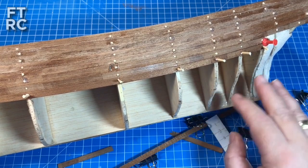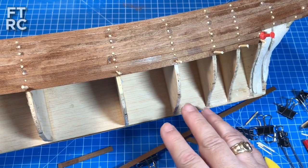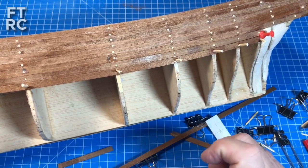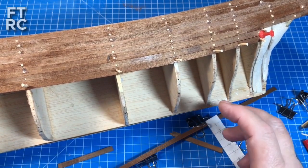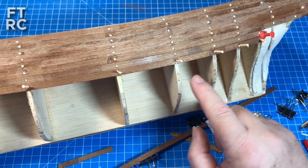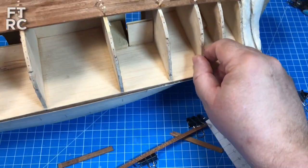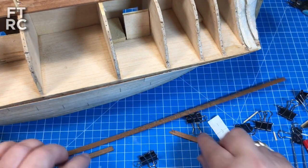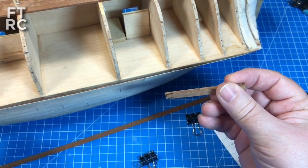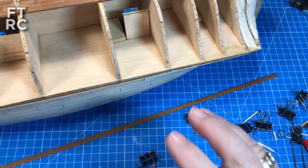So next time we will do those measurements properly, we'll do the table, and then you'll see me taper the planks and install them, and they should fit pretty spot on. If my measurement's correct. Now, yeah, it's a bit of math. It's a bit of head stuff, but really it's not that difficult. And I'll show you next time, because all the seven planks here will be tapered the same, and all the seven planks here will be tapered the same. So really, all you end up doing is you take seven of your planks, you put them all together, and you've marked out one to what the taper is, put in your vise, and you plane it to that taper. Easy as that. And then you've got seven planks ready to go. Okay, all of that next time.